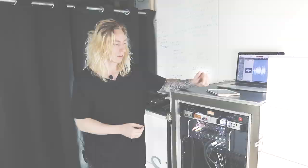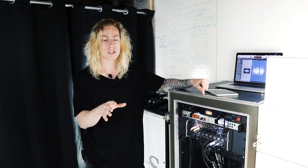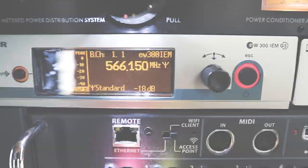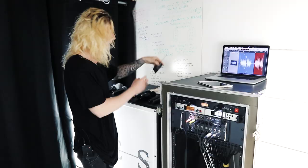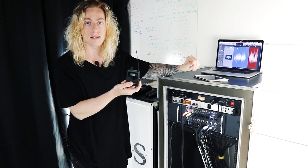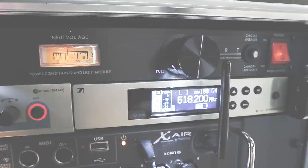I'll include links to all this gear in the description below. The next two are Sennheiser components. On the left is an EW300 IEM G3 — this is the base for my in-ear system, essentially a transmitter that syncs wirelessly to the belt packs. You can run two packs with the same signal in stereo, or two mono signals to two different packs. For now I just run it in stereo off one pack.